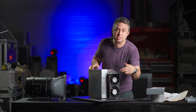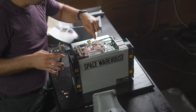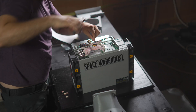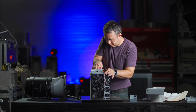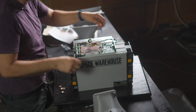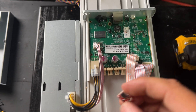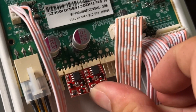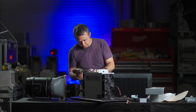These fans are connected with colorful cables that go under the bus bars and to the board on top. In order to get those off, there's a little tiny zip tie on top you're going to cut for the hashboard cables, and then one more little zip tie for the power that goes to the main board. Very simple — you can just simply pluck these out. That's all four fans. Pull that under the bus bar. If these have been running recently, be careful about the bus bars — they hold a little bit of power for some amount of time. This is your control board, where the fans were plugged in. Your little fan spoofers just plug into those slots instead. These will tell the miner that it has fans connected and that they're spinning. Importantly, if it overheats, these will still allow it to shut itself off. With the fan spoofers connected, just take the fans themselves off.